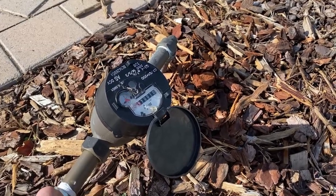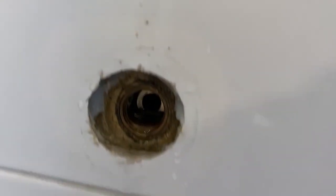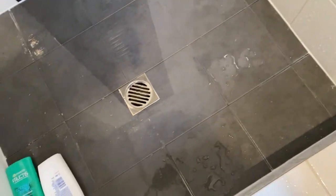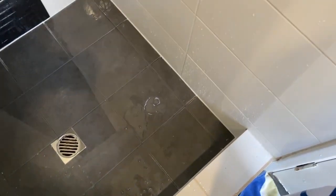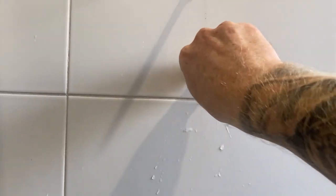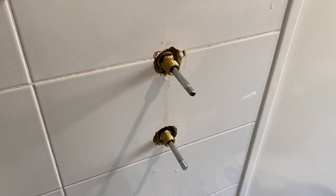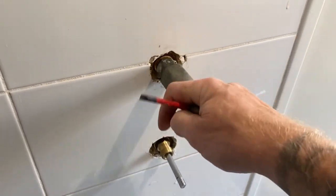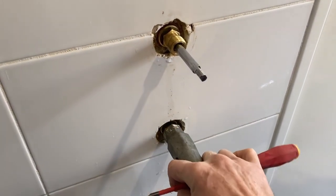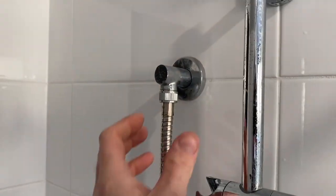I'm outside turning the water back on and flushing through water — water would have been gushing out of the wall while I was outside. What that does is allow all of the filings from reseating to come out, and they're just laying on the floor now. In this instance, those taps weren't installed correctly, so I'm replacing the tap sets — two new spindles going in, with new washers on top of the new reseated sets.